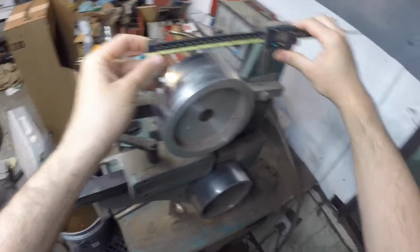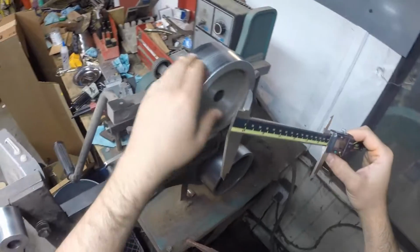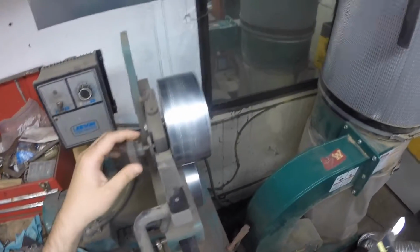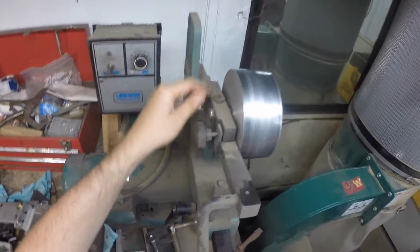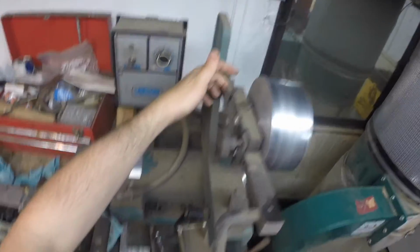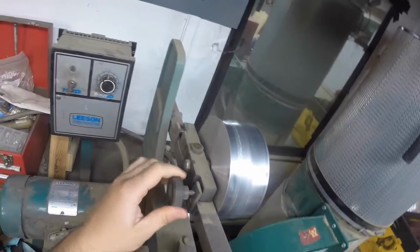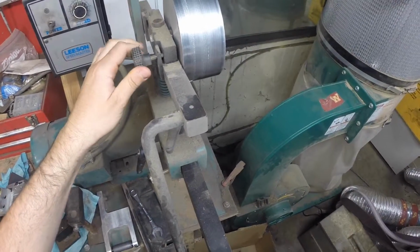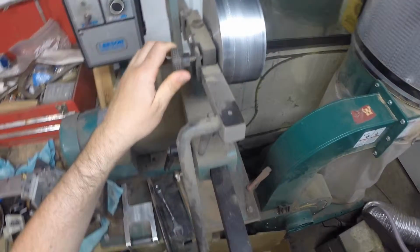It's what looks like a 6 inch at its crest idler wheel that has the guide, let's see, the belt direction function. So it pivots from this spot. The spring keeps tension on this block here. And it takes about that much of a turn to make maybe an eighth inch difference in where the belt is running.